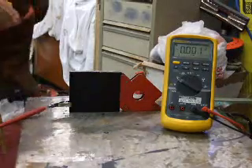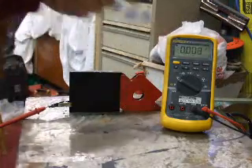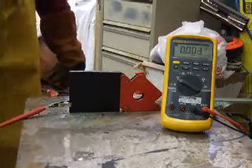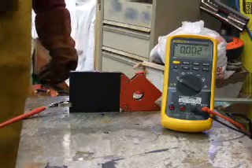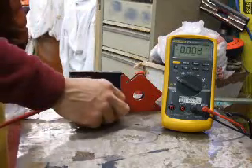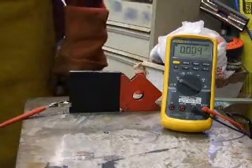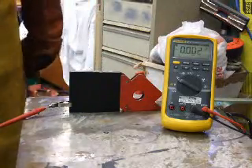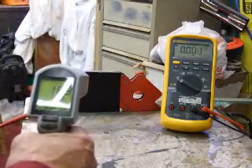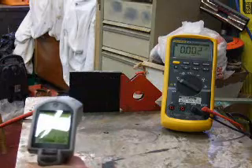I am going to repeat the experiment with the plate using the MMA process. We are measuring on the meter the voltage of the arc between the electrode — which is a flux-coated electrode 6013 — and the workpiece. I have now coated this plate matte black to get a better reading with the IR remote temperature gauge. We are starting at a nice consistent 18.9 degrees everywhere.